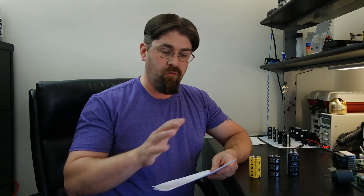The other thing I tested was the self-discharge over a 72-hour period — at 24, 48, and 72 hours. All three were charged initially to 2.7 volts. For the Eaton, after 24 hours it was at 2.36 volts; at 48 hours, 2.30 volts — only a loss of 6 hundredths of a volt.